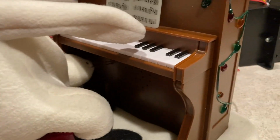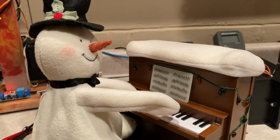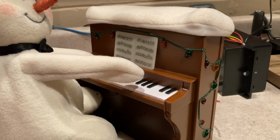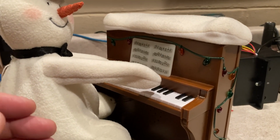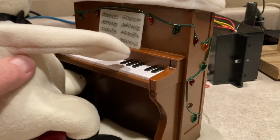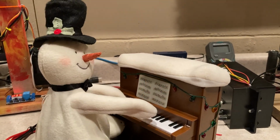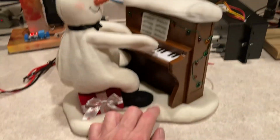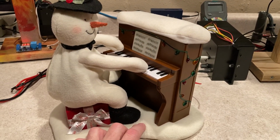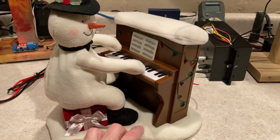So when he turns to the right, clockwise, then it has to make a leaf switch. When it makes that leaf switch, then the mechanism engages, and then it swings him back, and then the other leaf switch says, okay, he's back to home position. And that's where he's at now, because you can start it instantly every time you hit the button. You don't have to wait for the controller to time out if that leaf switch is not made. Yeah, see, it'll start up every time.